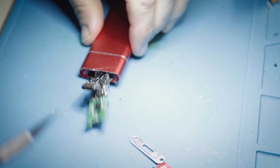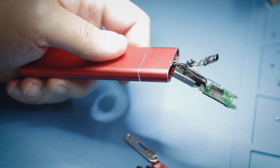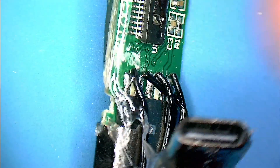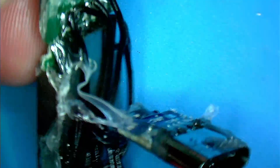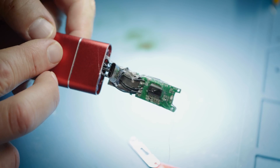Got it out — here's what it looks like. Under the microscope, you can see they have a reversed USB flash drive with wires running to it, same as the first SSD. It's the same type of USB flash drive — fake two-terabyte SSD — and they put tons of glue in this time so you can't get it out easily. That's what's inside.